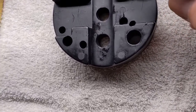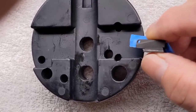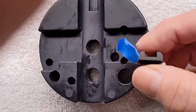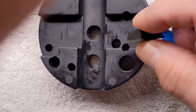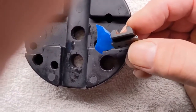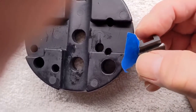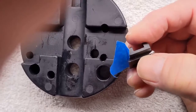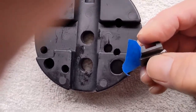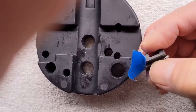So there's the other side, and where the tip of my thumb is pointing, that's the front edge. So it's not deforming the metal much there. Oops, sorry. So there, not much. I'm looking through the camera, so I'm having a little trouble orienting. That's where I'm going to do my filing, and I'm going to file across the whole length of it, not just this. But I think I need to take not even maybe a tenth of a millimeter, maybe 1/10 of a millimeter off of there. That's not very much. But that's what I'm going to try and do with my triangle file, a diamond file.